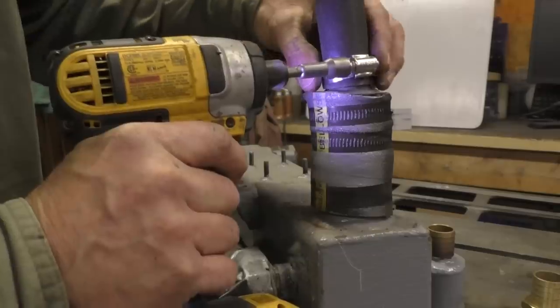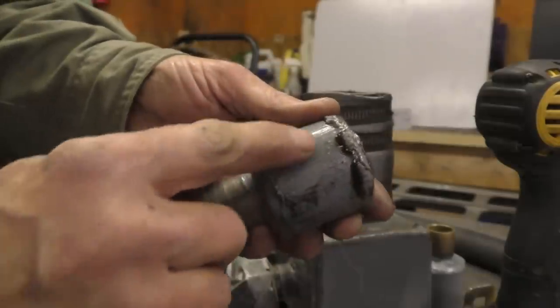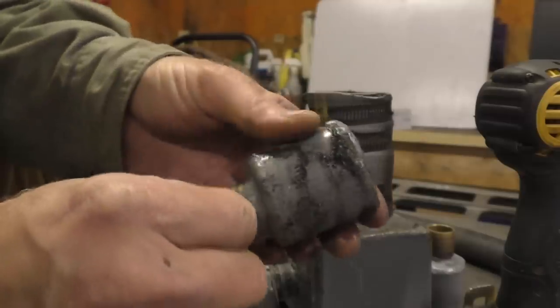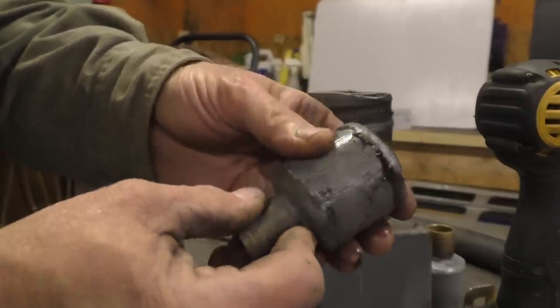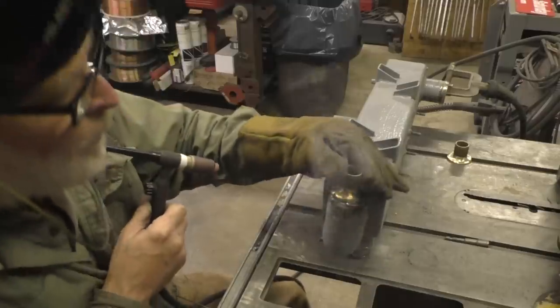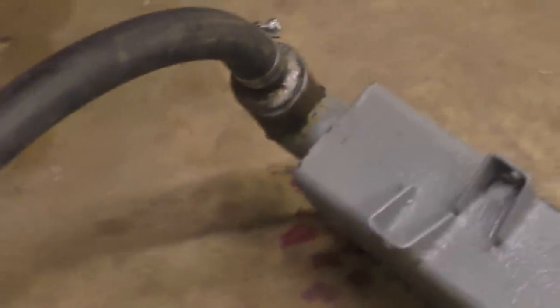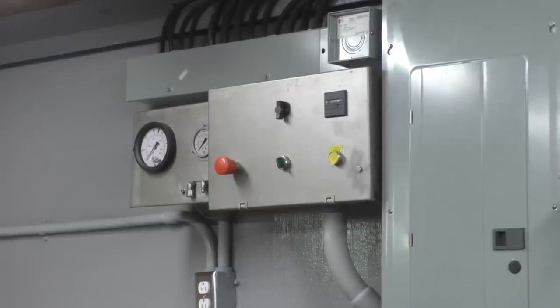That should have it. Water flows a lot better than that concentrate. Adapters I made for this heat exchanger are leaking, so I'm going to make a change to them. In fact, I'm going to get rid of them altogether. I think part of the problem is this epoxy paint has too many brush strokes in it, and it just seeps around the side of it. This one's not actually leaking, and sure enough, it's smoother than the other one. Gotta fix that. Okay, finally, no leaks. Okay, cleaned up the wire and the hose there, but still gotta read the owner's manual though before I kick it on.